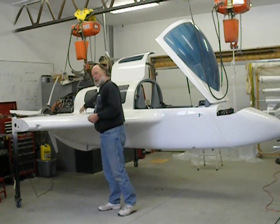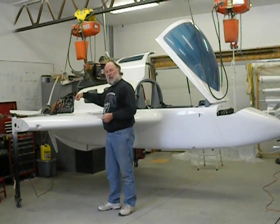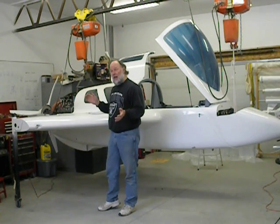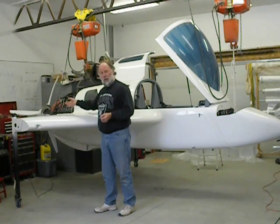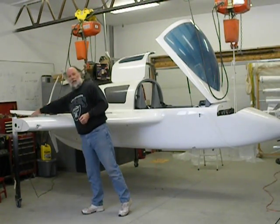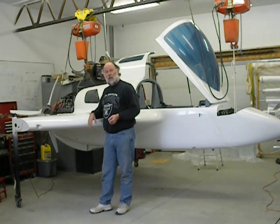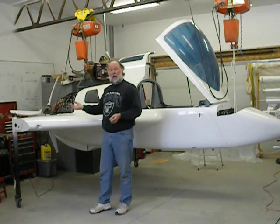The landing gear is sitting inside the fuel tank and the wheel is sitting at fuselage station 110, bearing in mind that our fuel average is about station 103 and our center of gravity is around about 100. This means we're taking out fuel from behind the CG. What I did was block in the rear of the tank, which is put in there to push the fuel forward in the case of the Long-EZ's and the standard Cozy.